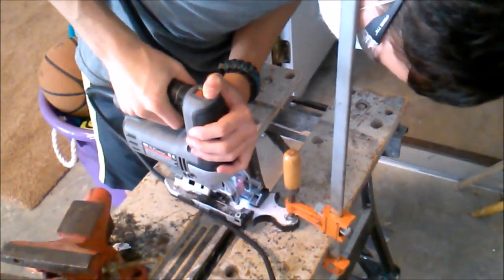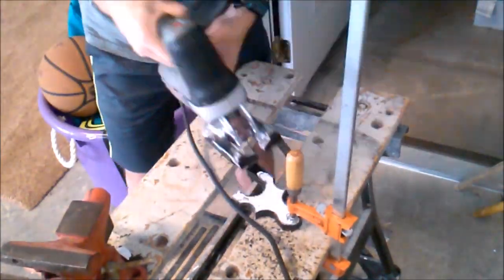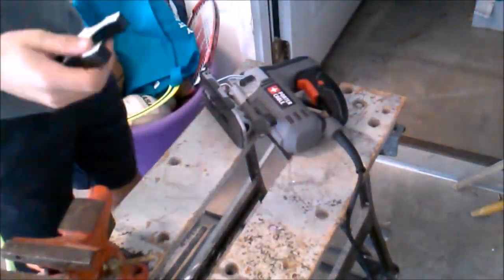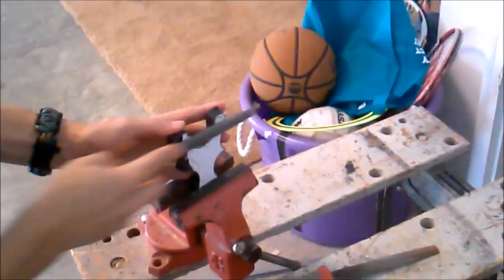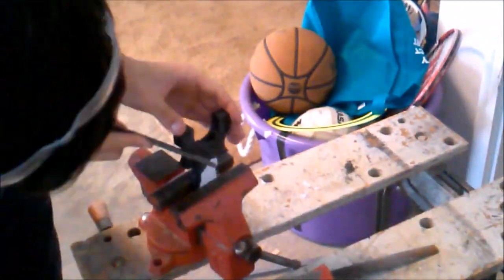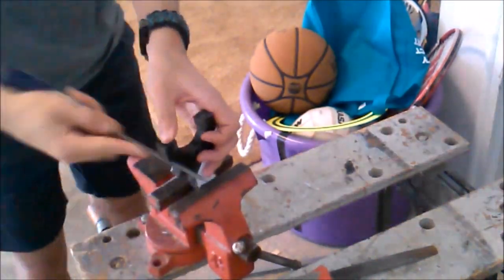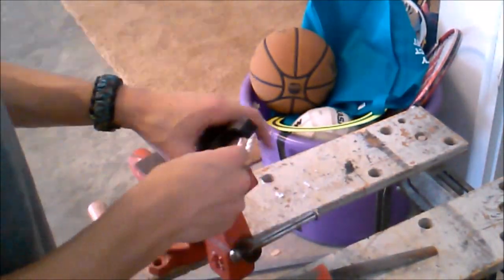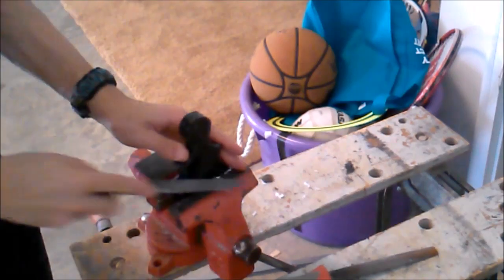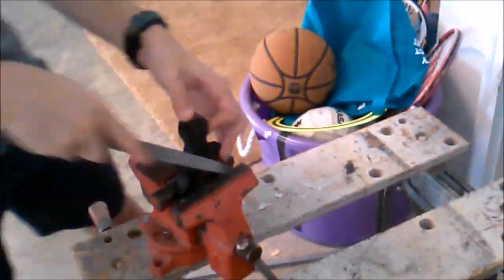A note of advice: just make sure both legs of the saw are on the table — or on the material — at all times. That'll keep the cuts nice and even. Now we're just going to sand it smooth, take the paper off the front, and shape it to your hand. You're going to want to round all the edges that connect to your hand. Take it out of the vise periodically and check it in your hand, because you want to make it feel perfect when you hold it.